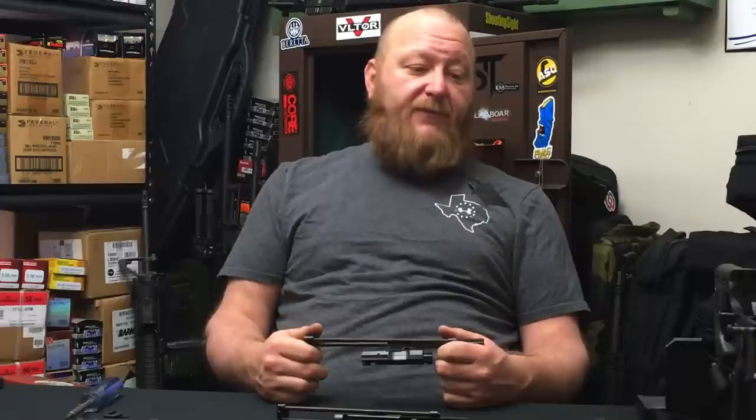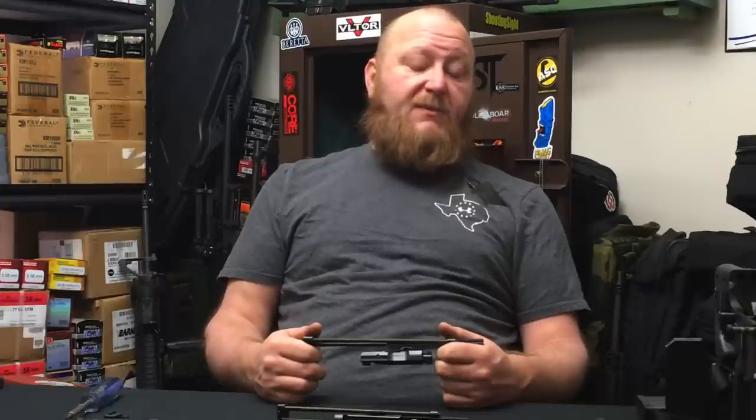But if you were to put a lighter-type primer, say a pistol primer or one that is not to SAAMI specifications, that little dent could possibly be enough to set that cartridge off. So Sig reacted to that very, very quickly, and quite frankly, I think they overreacted to it, because as a weapons manufacturer, you can't think of every scenario. You can't think of if an ammunition manufacturer is going to make something out of specification or not. You have your specifications that you have for military-grade primers, which is what manufacturers are supposed to be using.